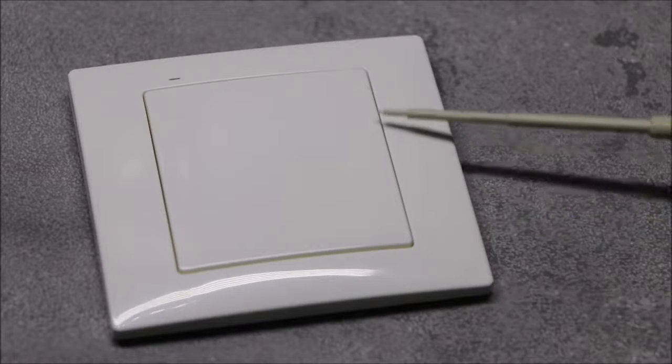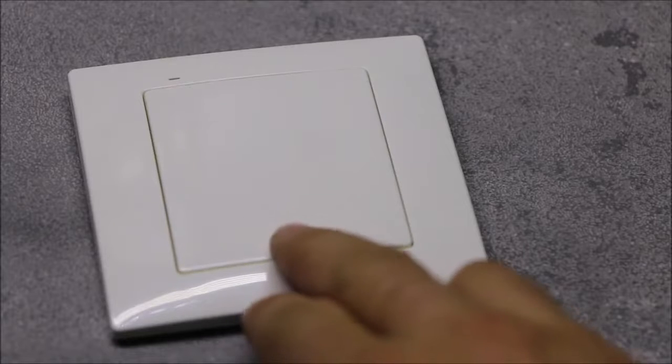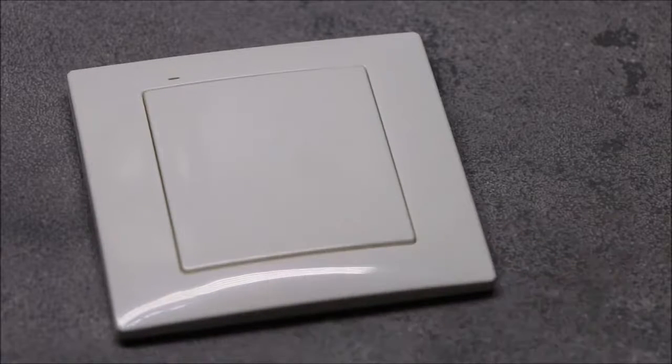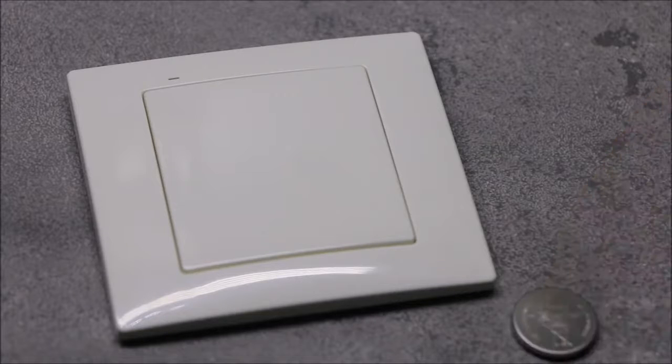RNK-02 has one large and convenient key, which could control up to 2 receivers independently. The LED during normal operation indicates signal transmission. This LED is also used as a battery discharge indicator. A single 3V battery is used for power supply. It allows operation for a 3 to 5 year period, depending on the quantity of use.